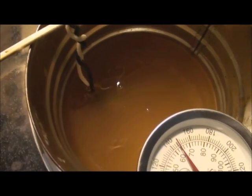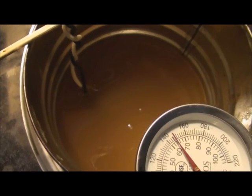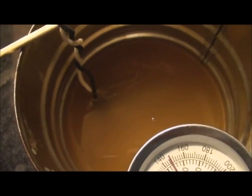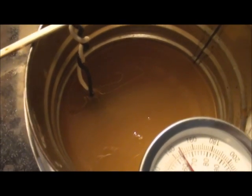As I said before, you go too hot, you also run the risk of a fire, but you'll also warp the bobbin and maybe melt off the coating off your wire, and then you got a pooched pup. Anyways, we will continue on.